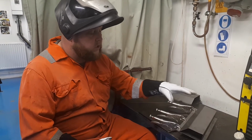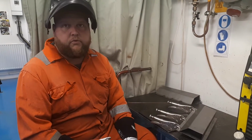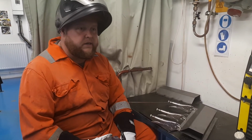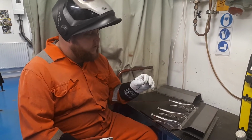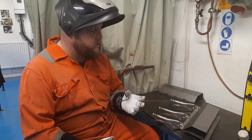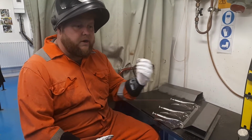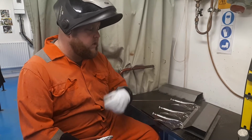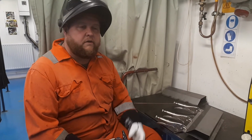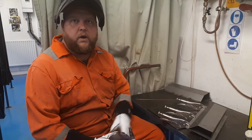The advantages of using TIG over MIG, for instance, would be that if you're working, could be on a restoration project, you haven't been able to fully strip the vehicle out, like for instance something like an old VW split screen camper, something like that. It means that if you were putting in a new window surround or putting in a trim like that, for instance, you wouldn't necessarily have to strip the whole vehicle out because there's no sparks. You still have to, obviously, within the vicinity of where you're welding, strip that area out. But in terms of fully stripping everything out, not necessarily necessary, because the sparks aren't going to travel. It's very localised within the area of where you're welding.